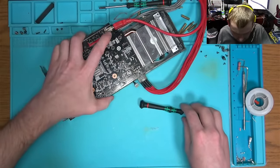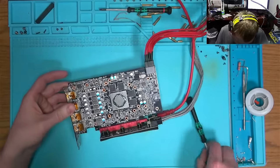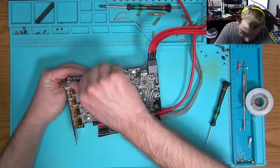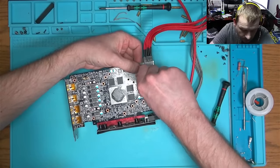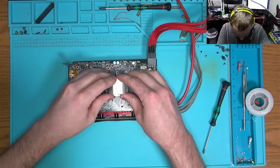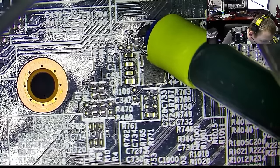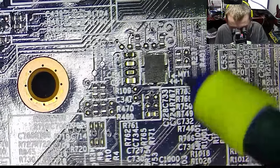I don't know — maybe we can look at the oscillator. The crystal oscillator that generates the frequency at which the core and the motherboard communicate with each other. I think we're getting 96 — a very unclear signal, but it's giving me like 99, almost 100 megahertz. I don't know if this is normal or not — I don't think so. It might be normal for AMD; these are weird.